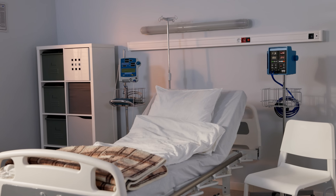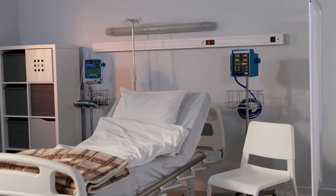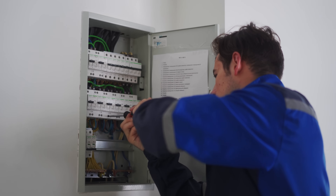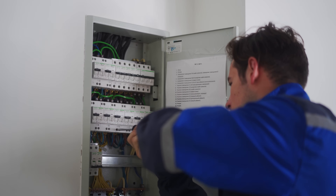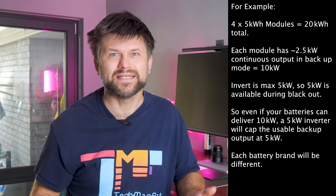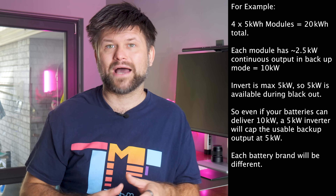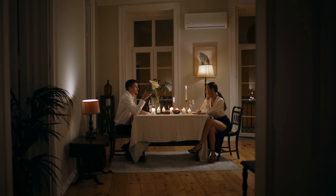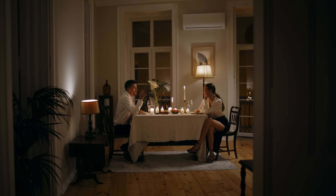If backup power is crucial — for example you work from home or have medical equipment — make sure to choose a battery or inverter that explicitly supports blackout backup. Some batteries like the Tesla Powerwall come backup-ready by default, while others might need an extra piece of equipment adding to your costs. Not only that, they generally only power a certain circuit inside your home. Battery backup is usually limited to the essential circuit: your fridge, some lights, and maybe wi-fi. So during a blackout you can't run your entire house like it's a normal day — heavy hitters like aircon or the oven might not be covered unless you have a big battery and inverter setup. But having the lights, internet and kettle running when the rest of the street is dark — that's a huge win.